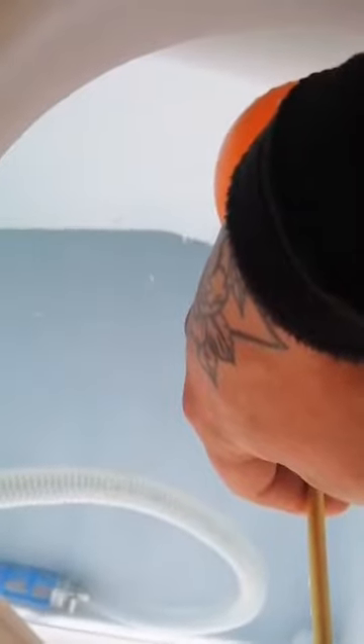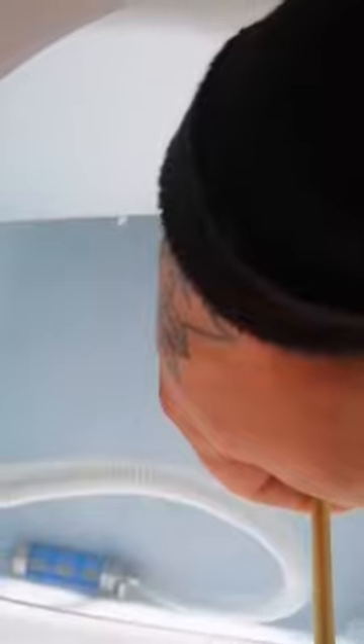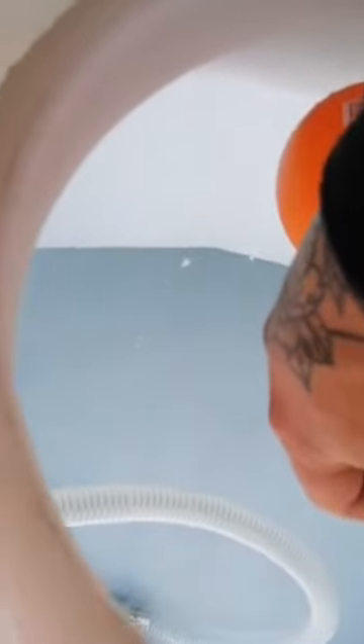You can clearly see there's nothing else coming in. So you're pressure washing away, your water's dropping down, water comes back on — simple as that. It stops any overflow because if you didn't have a float fitted and you stopped for a couple of minutes or you're changing your lance, it's still filling and there's a good chance it could overflow. I think it's a must, to be perfectly honest. Job's a good one.